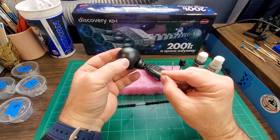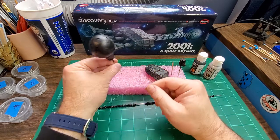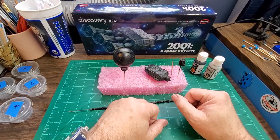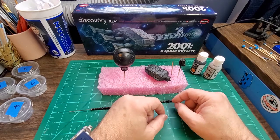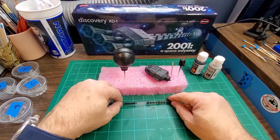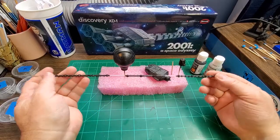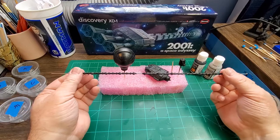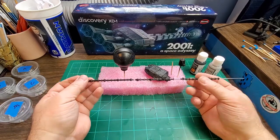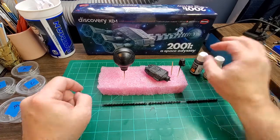Usually I typically just use some good quality automotive primer, usually black or gray, sometimes white, depending on what we're painting over it. So this was kind of a jump into using my airbrush for primer. And the airbrush I used, it's actually a really inexpensive one I got off of Amazon, with a number five needle cap. And the paint just flowed really well. And the paint was also very forgiving.